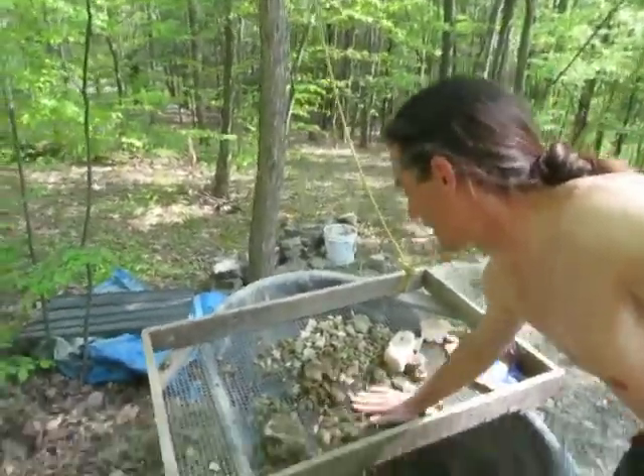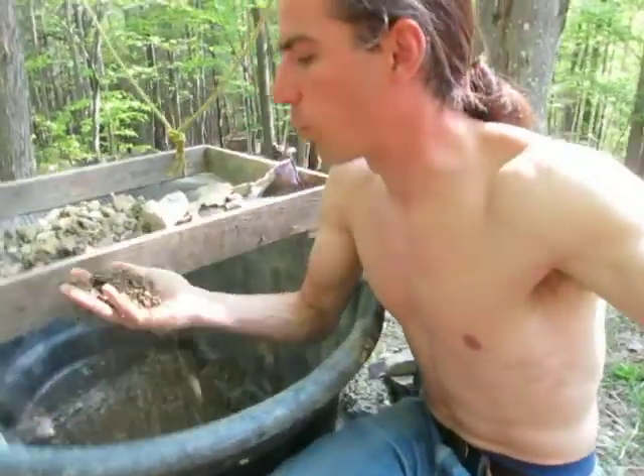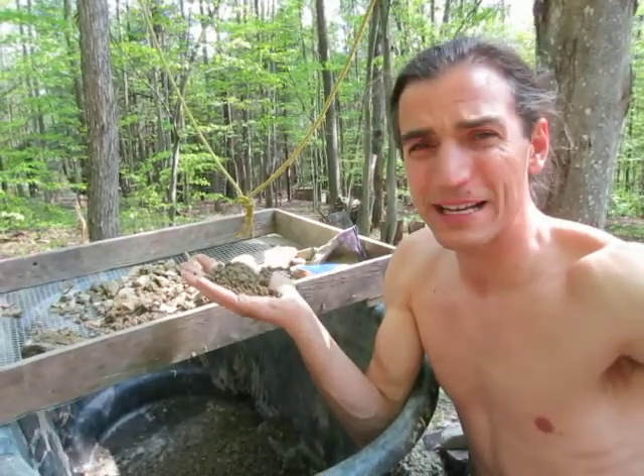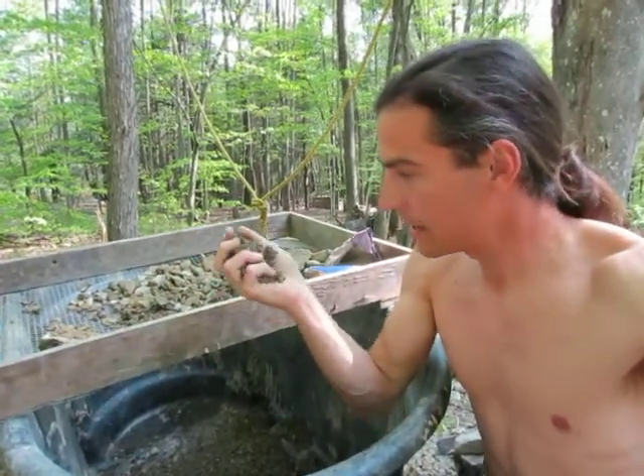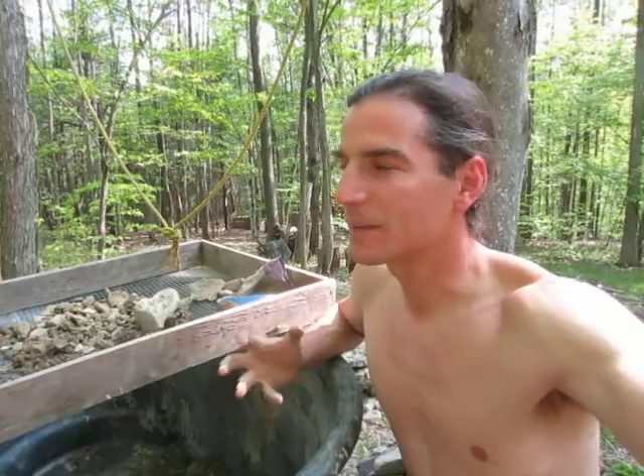All I'm doing is pressing and screening — and this is the silky stuff. When I add water to this, I'm gonna let it soak for at least 24 hours, preferably like three days before I want to use it. And I'm gonna add sand to it, add my straw to it, make my cob. And I'm a happy man.